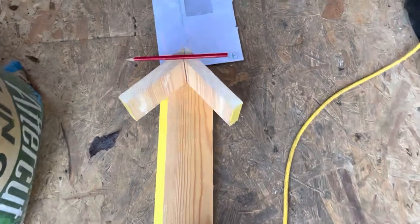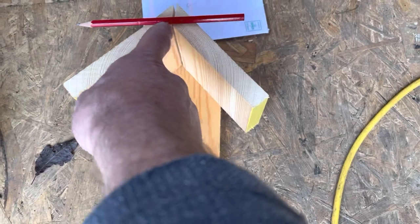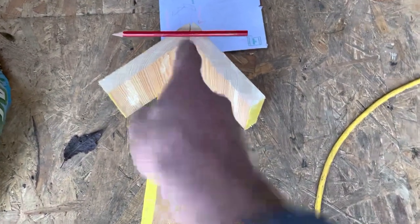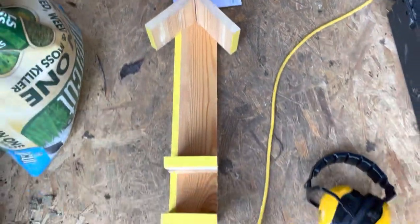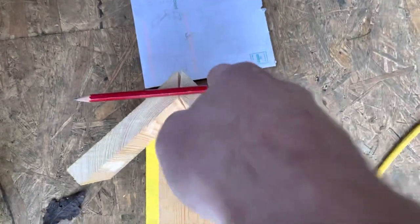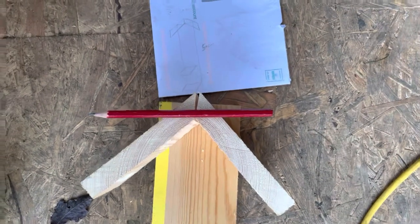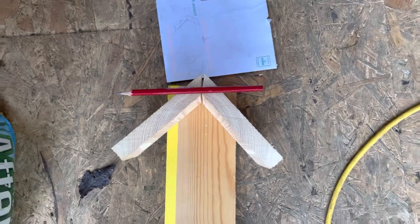So after a bit of cutting and trialing to see how it looked, I've settled on those dimensions. That actually works out to 12 centimetres from the shortest distance. It's literally just setting up a 45-degree cut — that forms the apex. You could cut those bits at the very top to mirror the actual roof line, or leave it on and use that as your fixing bracket for what is to be the feeder. I think I'm going to leave it just because it's going to be easier.